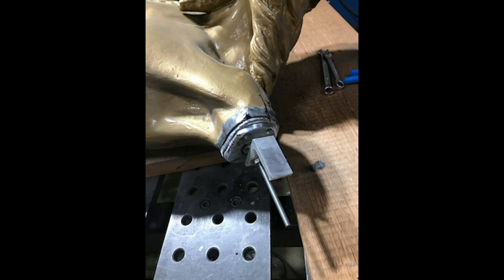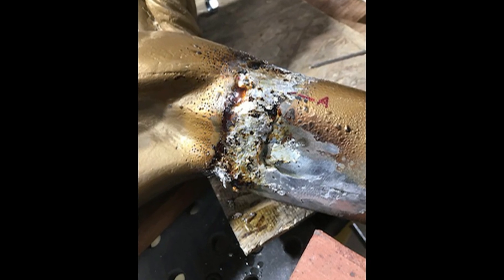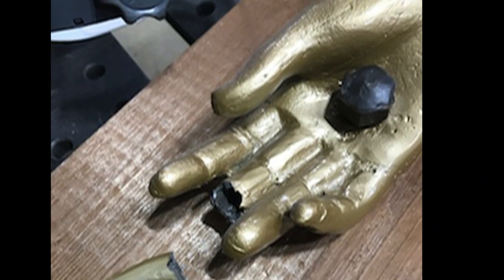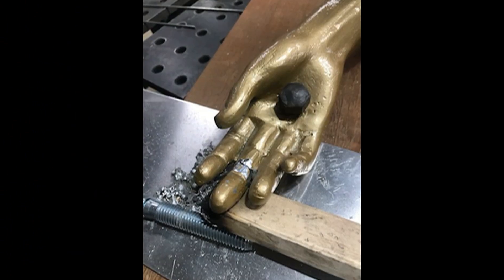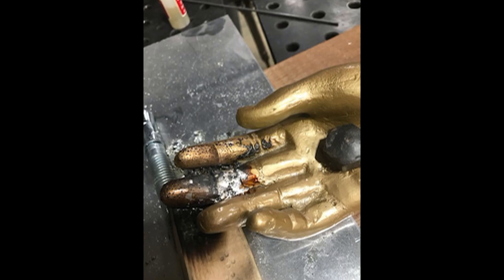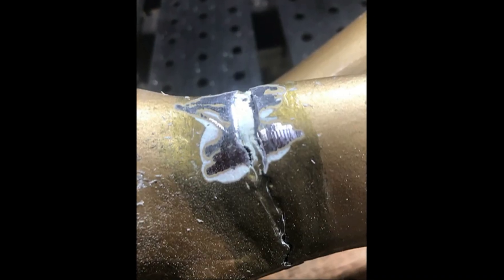To see the rod and flux in action on other white metals, click this link in the upper right-hand corner. This innovative alloy has a working temperature of 350 degrees Fahrenheit — that's less than half the temperature of the 787-degree melting point of zinc. The liquid honey flux paired with the Super Alloy 1 rod helps the alloy adhere to the parent metal. The flux also acts as a temperature guide, warning the worker when the zinc is approaching the maximum bonding temperature of the solder rod.